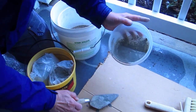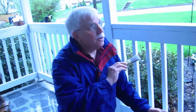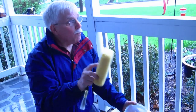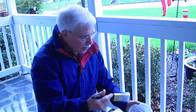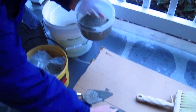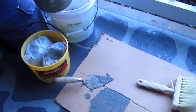Once the concrete block is clean and you've got all the loose stuff off, take a little spray bottle — like an old Windex bottle — or just a sponge like this. Get it wet and just dab the concrete block a little bit, just get it slightly damp. Then take your paintbrush and paint this cement mixture right on the place you're going to patch.